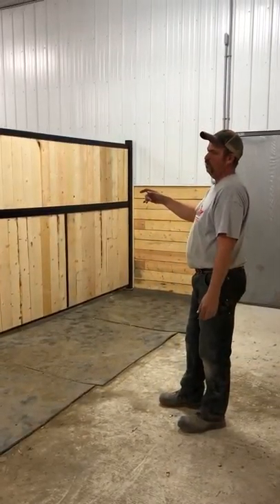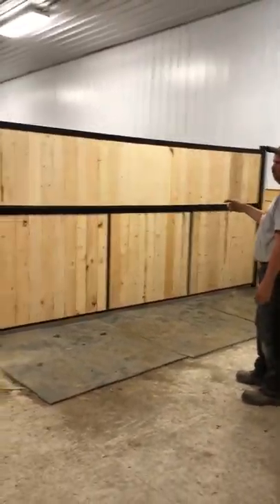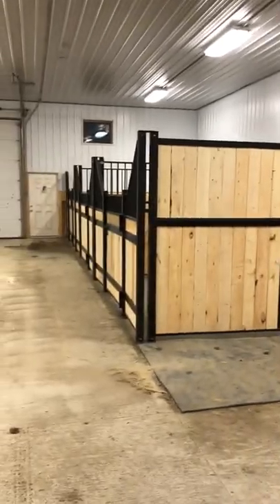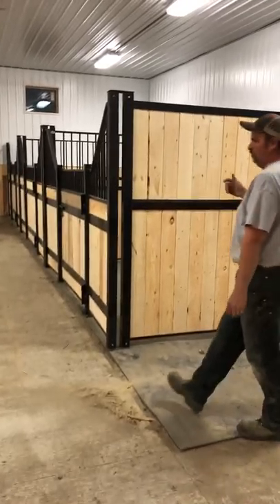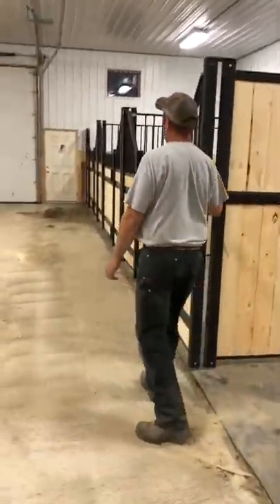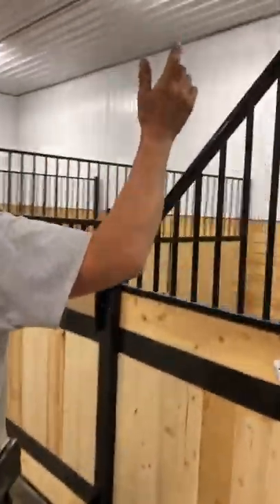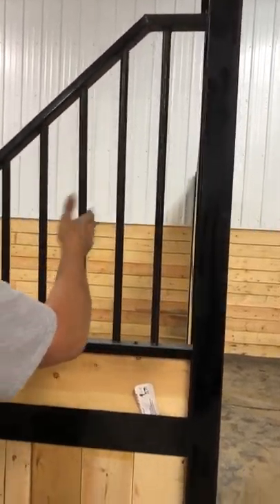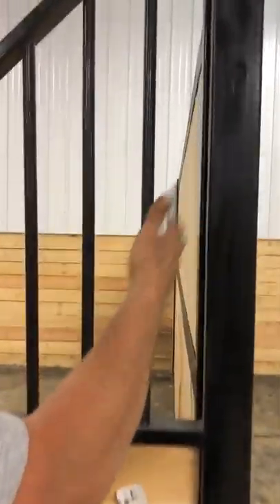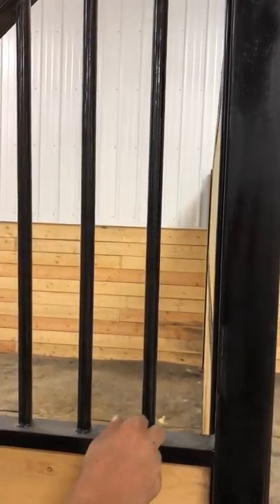This set of stalls is all 3-by-3, 125-wall square tubing. On the posts, the front strap plates are all 3/16 by 4-inch flat, and it's 1-by-2 rectangular tubing, 125-wall on the scalloped fronts. Every bar is actually a half-inch schedule 40 pipe — they measure just under an inch in diameter on the outside, and they're spaced every 4 inches on center.